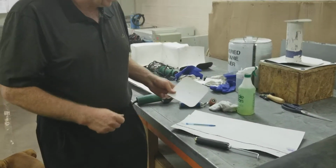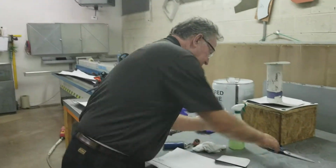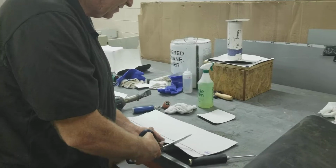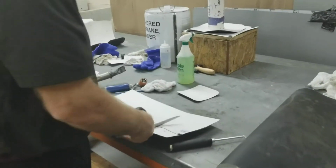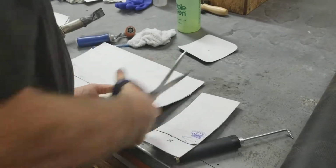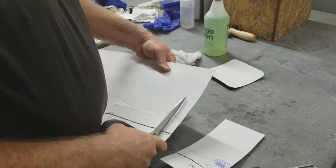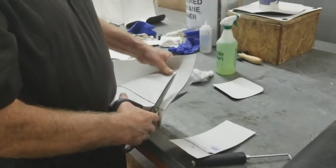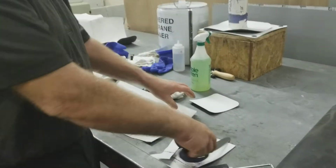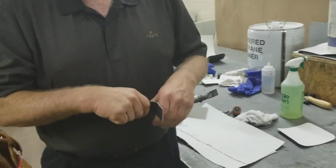So that's that. We're going to show you how to do a test cut in that area to show you if you truly have a good weld. And the whole thing about test cuts is that you only want them to be about 1 inch wide max. So this is something that you wouldn't want to be doing on a regular basis to your complete roof, but the manufacturer actually does want you to do it. The manufacturer actually wants you to take some test cuts, like in your walking welder and stuff like that, and potentially some hand welding.